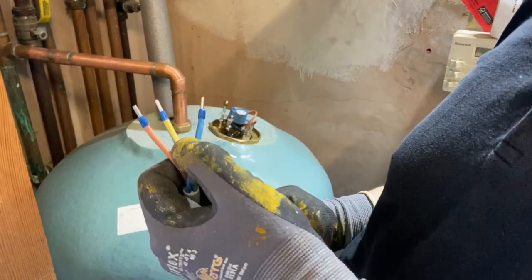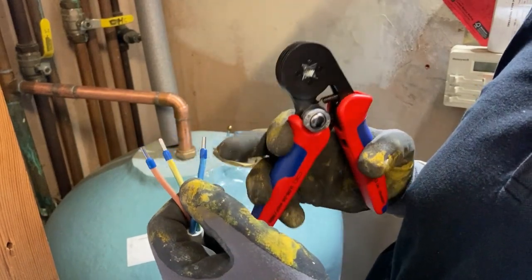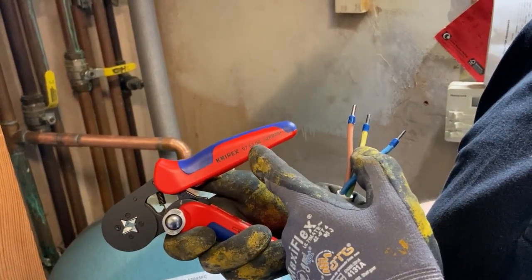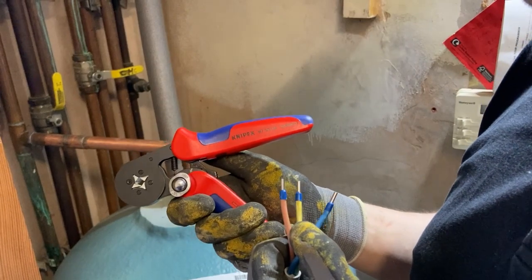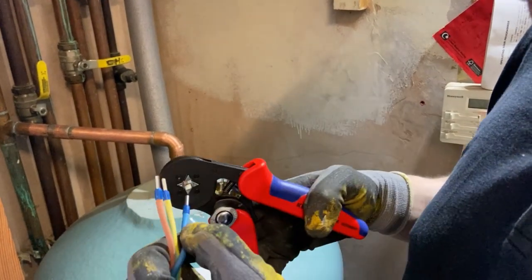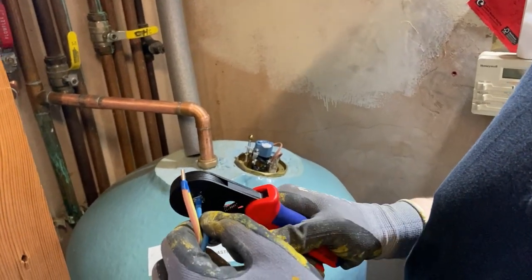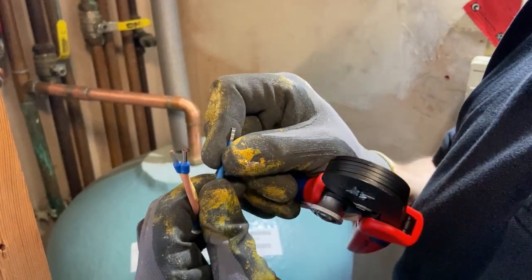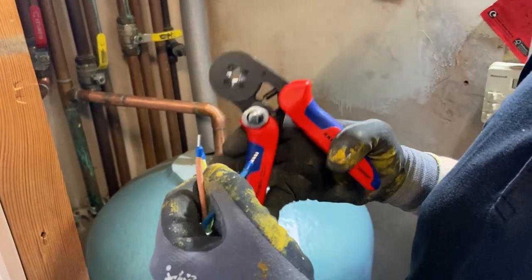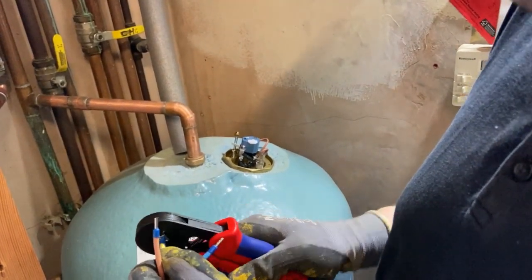Okay, so now we need to crimp ferrules onto the immersion flex as it's stranded conductors. So we're using the Knipex crimping tool, specifically 975304. Again, for this one, I will put the details in the description below. All you have to do is choose your correct ferrule, place it in, butt it up to the point, and crimp and release. And then you have a nice solid crimp on that ferrule, and it does it in a nice square method. Just do it again on the earth, get the ferrule, crimp, and done.